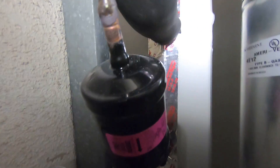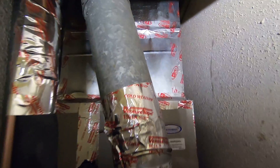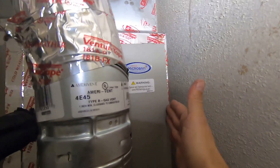We have a filter dryer and refrigerant lines coming into the coil, which also connect to the condenser outside. Above that we did a brand new supply plenum. Air gets brought in through the return grills down here — we sealed the return box so air is pulled from the house, not the floorboards — and goes up through the furnace, through the coil, and up through this supply plenum into the attic, where you can see ducts coming off wrapped in pink duct wrap.